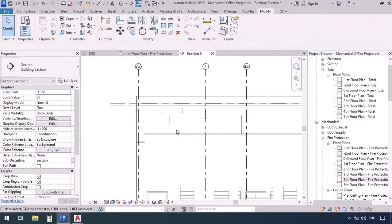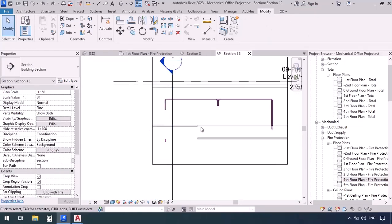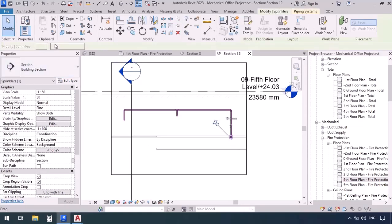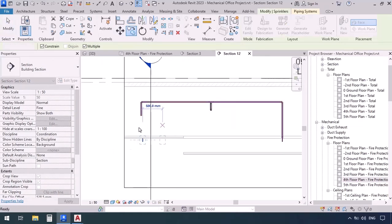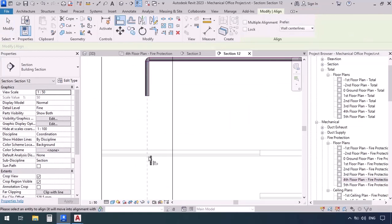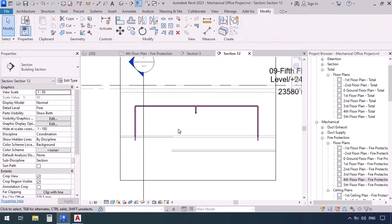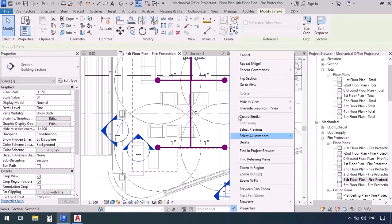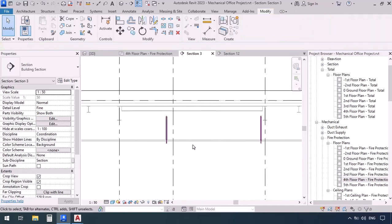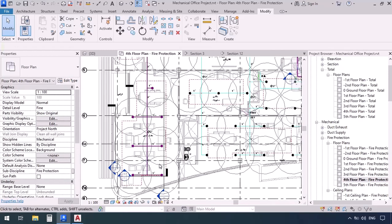We just completely lost it. Even if this error won't go away and keeps bothering you, you could just first delete this, then take the sprinkler and copy it — just the sprinkler itself — from here to over here. Now that it's been placed, we're going to align it with this pipe, then drag the pipe and connect it to the sprinkler. The host wasn't properly recognized and only caused this problem, so I just deleted it and drew it this way. Now what about the ones on this side? Let's go check their hosts — this one's properly placed, and so is this one and this one. Even though copying was a shortcut to save us time from drawing everything all over again, we had to re-host our sprinklers. If your ceiling was one piece with only one elevation, then copying is faster for you.